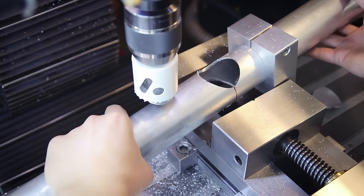With these supports set up, I can make sure the side pieces are parallel and at the correct height. I'm using a ratchet strap with some light pressure to pull them against the frame, but I'm not going to start welding anything yet. I first want to make and attach these bottom side pieces, which add some stiffness to the frame and also provide a place to mount the kickstand. Making these is basically the same process as before, except it's a bit simpler because there are no fancy angles — just straight 90 degrees.